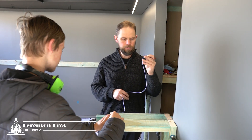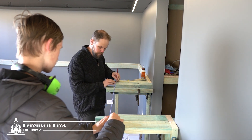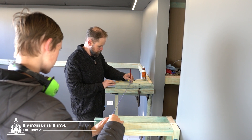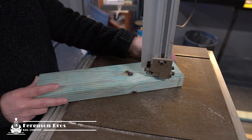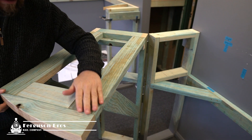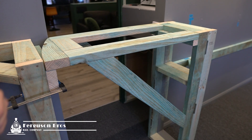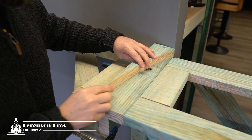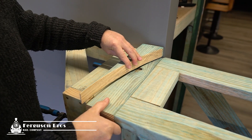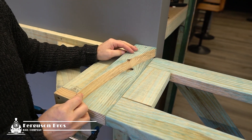We're just doing a basic arc here with a pencil and a bit of string, pivoting at the same point where the hinges go, and we'll draw an arc on the other side. This piece in here is still a little bit too tight along the edge, so I'm going to have to shave this off a little bit and shape it so it makes a nice arc on the inside edge. Just needs a little bit taken off the back, and then the top sheet will hide that gap and the imperfections.